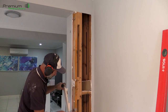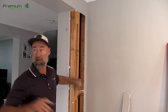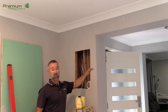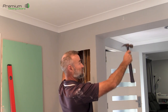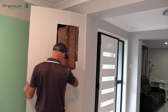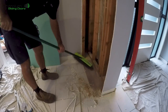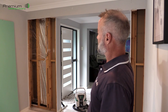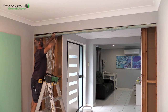The good thing now is that exposes our frame. It's going to be a little bit tricky cutting it all out, but basically this is where our cavity slide is going to sit — same on the opposite wall once I strip that side of the plaster. Good news: that inside frame is actually not load-bearing. The joists are running from the front of the house to the back. The next thing I do is frame up for the new opening size of the two sliders — put that headpiece in and drop two studs down each side.